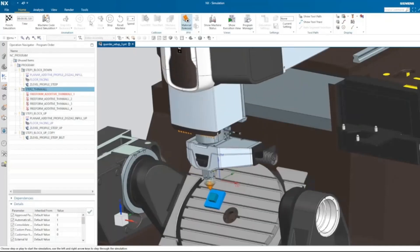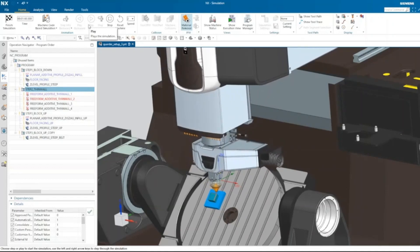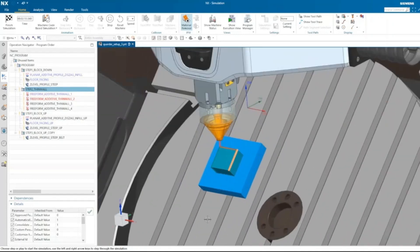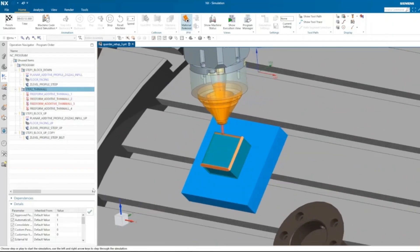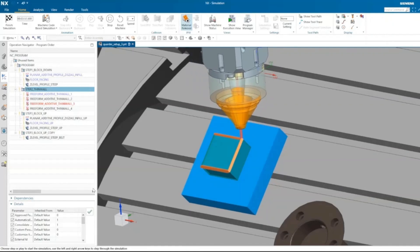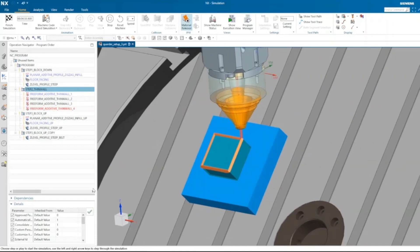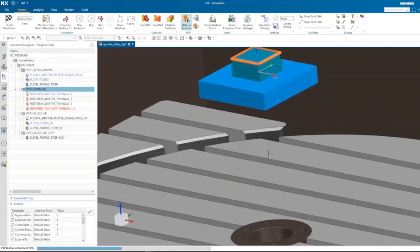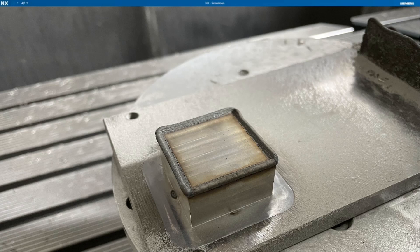The table should be tilted at a 45-degree angle. And we give a thin wall additive boundary on the top surface — at every four corners of the top surface, we will give a thin wall additive boundary. The height is 2mm only. This very small additive boundary is applied at the four sides of the top surface. We will then have a closed thin wall boundary, so we can hold metal powder inside of the thin wall boundary, and the molten material will stay there. Laser cladding can then continue in the Z direction.